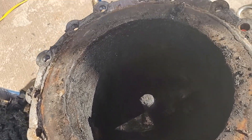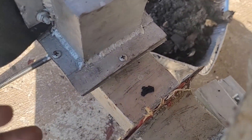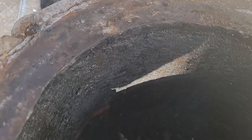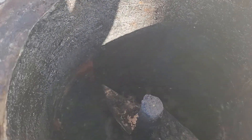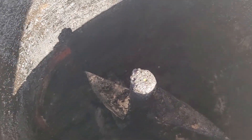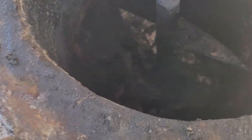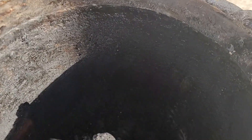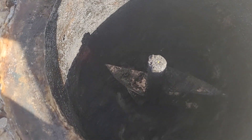There's also a very interesting effect I haven't been able to fully explain: if there's any material right in front of whatever is covering the waveguide where microwaves are coming from, it does some type of electrical arcing thing that destroys everything, including the fiberglass. An issue with the magnetron being at the bottom is the spinning blades push material toward it. It destroyed the upper one. If I move the waveguide higher, degraded material will be heavy and fall down, so it won't come up and block it — that should help.